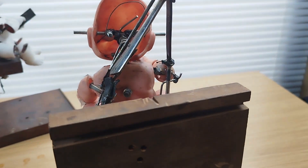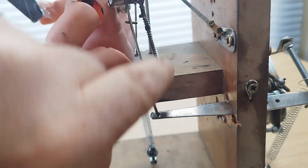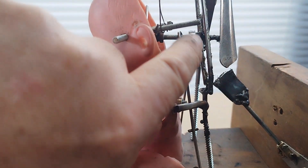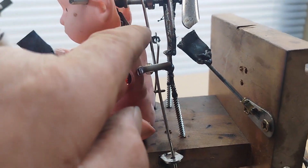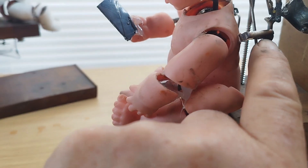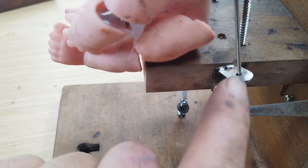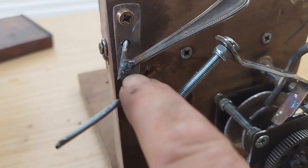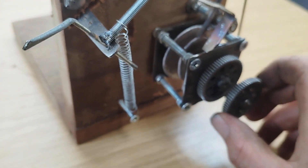We've had some pretty big adjustments made now. Where this slot was, it was pulling through that hole and because it was against the angle of direction it was creating friction. So I decided to pull it in the right direction — just along there, no friction. I put a guide hole in, then another guide hole, and then drilled another slot but diagonally, which you can see there. It works a lot better now; I've still got to grind down some more for the head to go down further. When we turn it now — there, it goes down.